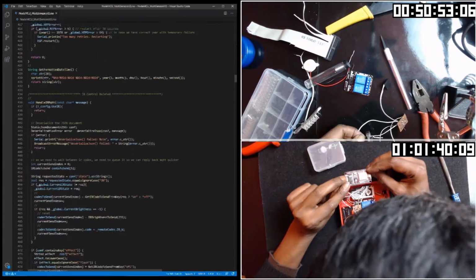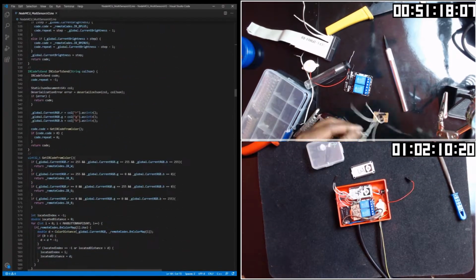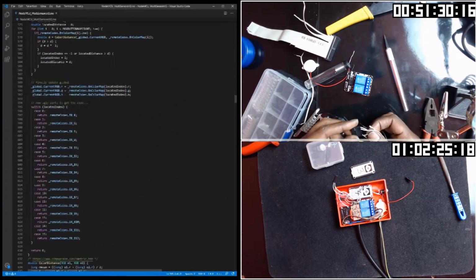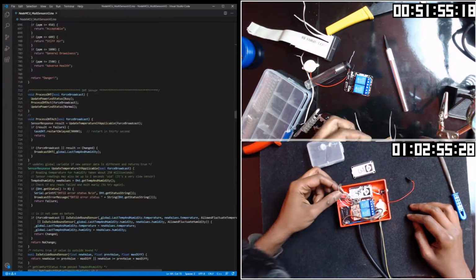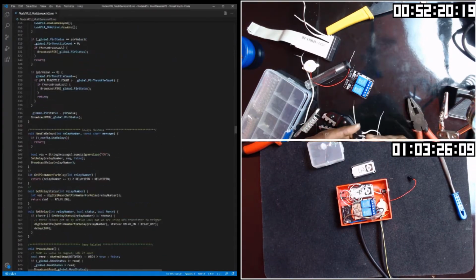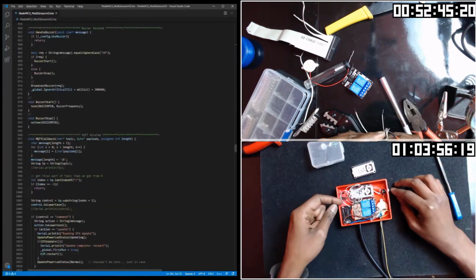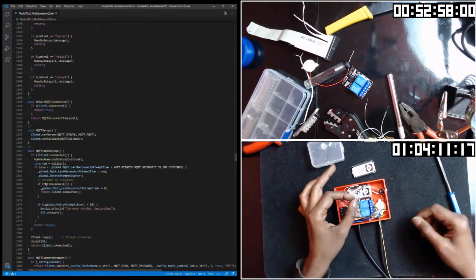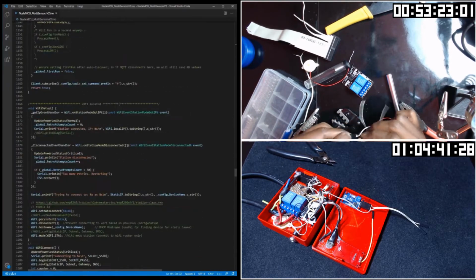Finally, I would like to talk about the transistor drivers. There's a limit on how much current a NodeMCU can output. On a different project to control my house heater, I have a NodeMCU connected to only one relay and a buzzer. In that case, it had enough power to drive the relays without using the transistor driver. But in this circuit, it's not the case.